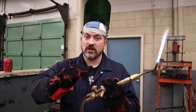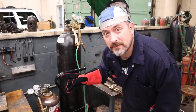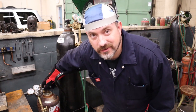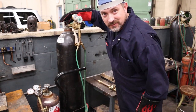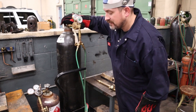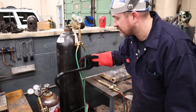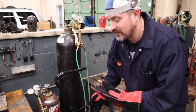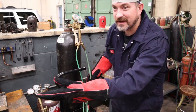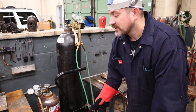When you're done welding, shut it all down — A before O, clockwise. Acetylene first — close the torch valve. Then oxygen. Now shut off the main bottle valves — again, A before O. Acetylene only takes one turn to close, righty-tighty. Oxygen is the double-sealing valve so it has to be closed all the way. Technically we're all shut off, but we're leaving a dangerous situation because the hoses still have oxygen and acetylene in them under pressure.